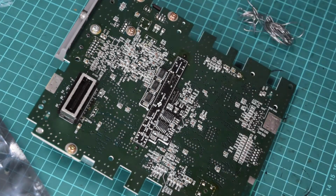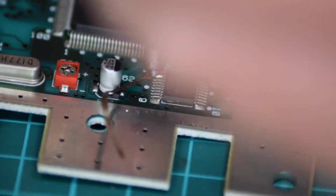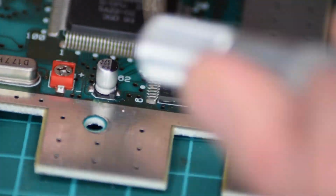Next we have to do something about the SNES's own kick chip. Kick, or CIC, stands for Checking Integrated Circuit, and this thing handles the region locking and anti-piracy for the console. Our mod chip replaces it so that we can do all the new funky stuff. If you have access to a heat gun, you can remove this chip altogether. I couldn't get one at the time, so the other option is to remove the power connections to the chip, making it a dead duck.